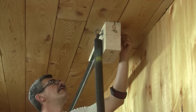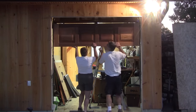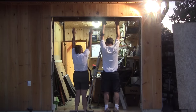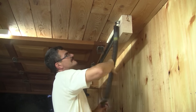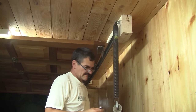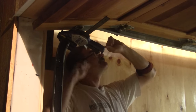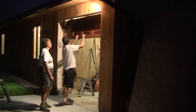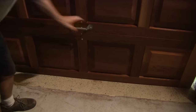It's time to install the door's springs. I drill and install the springs in place. But before I can work on this, we need to open the door. I'm so lucky that Renée is always nearby to help, because I wouldn't be able to lift that door by myself. But I just realized that I put the springs on the wrong side of the ceiling block, so I remove them and place them on the right side. Then I can tie the metal wire to the rails. Finally we can try the door. It's working, but we have too much pressure on the springs — the door doesn't stay closed. I untie the wires and retie them with a tiny bit less pressure.